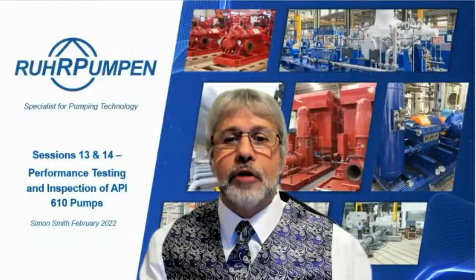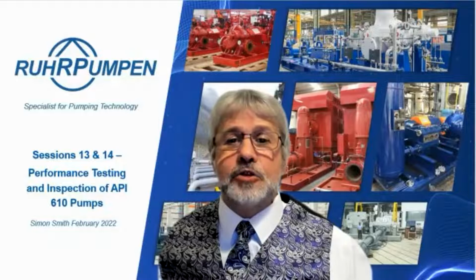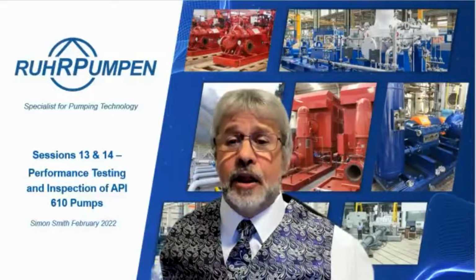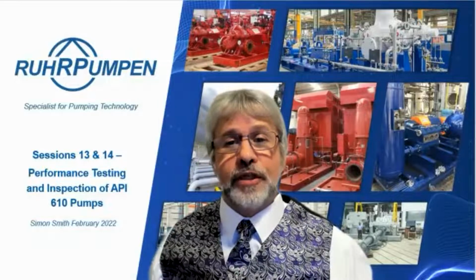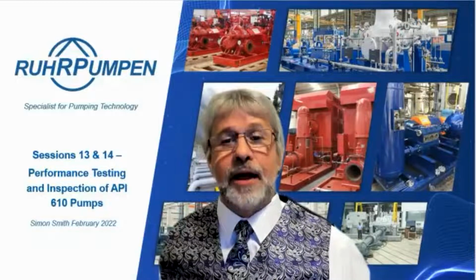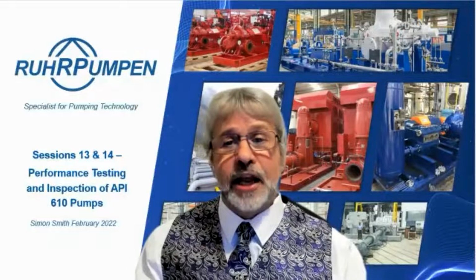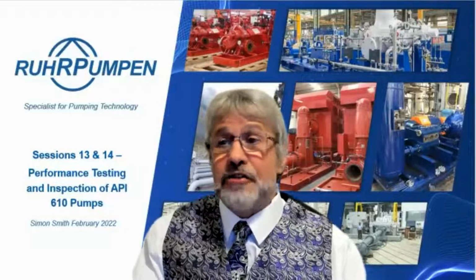There's one from Raghupathi, who says, in a performance test, if power meets within the API tolerance and head does not, what causes the head not to meet? Well, if the head's not meeting, it's probably a blockage or a fault within the impeller. We'd have to take it down, have a look and measure the impeller and see what has gone wrong. Could be lots of reasons: bad machining, bad casting. We'd have a look at it and if necessary, replace the impeller.